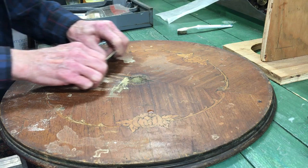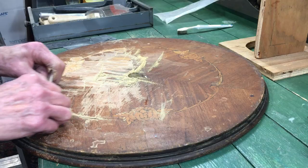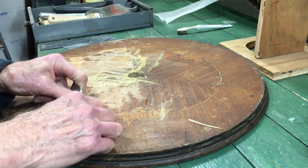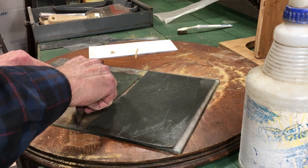There's some of the damage. I'm going to scrape the finish rather than sand because the veneer is very, very thin. I just broke some of it, so I'll have to save that piece and put it back in there — I'll be very careful.